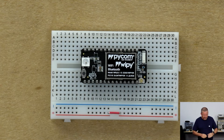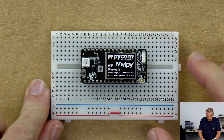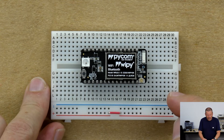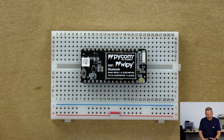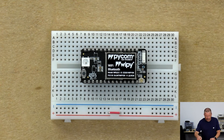Let's have a look at the bench. A Pycom microcontroller — any of them — will go straight into a breadboard. All you really need to do is provide power at the top, in the range of 3.3 to 5.5 volts. By default, your microcontroller will create a wireless access point which you can join and then program it using Telnet and FTP. It's important to note there's no reverse bias protection on that power socket, so if you get the polarity wrong, you'll do damage. Also, the pins are not 5-volt tolerant, so make sure you're only using the 3.3 volts supplied out of the third pin for any peripherals that come back into the microcontroller.